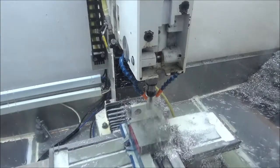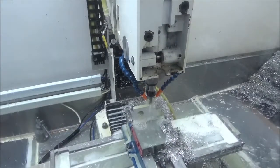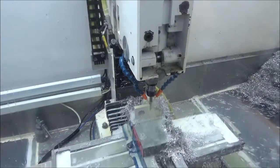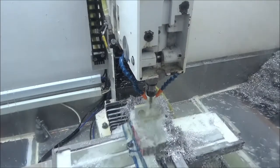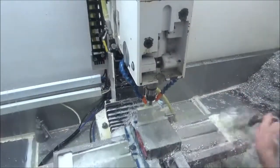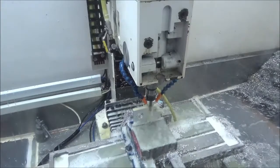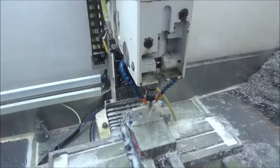I really don't like that. A lot of tool pressure there on that tool. Probably could have split that depth of cut up a little bit and got rid of some of that. That's like that piece of foil there. That's how much pressure's on that 2-inch long end mill. Just so happens it lines up with this slot pretty good, so it'll kick it off when it reaches that center line.